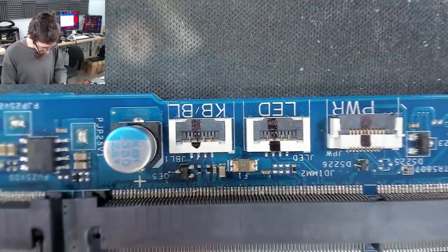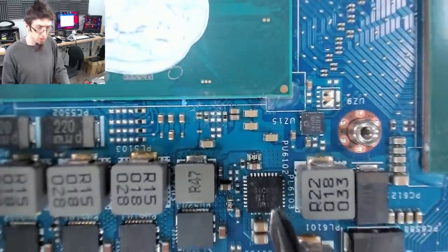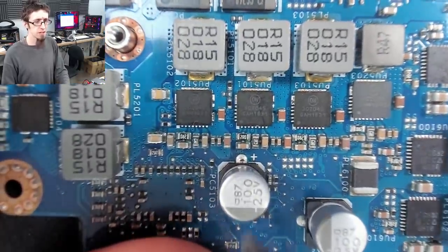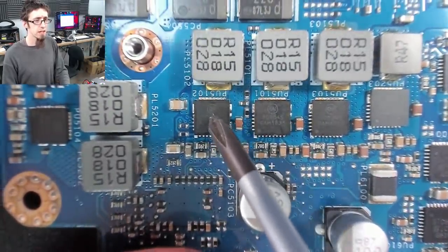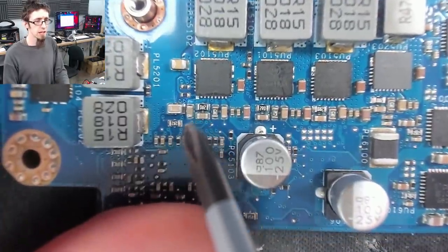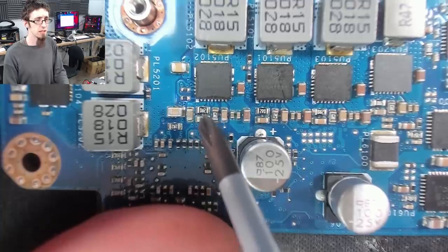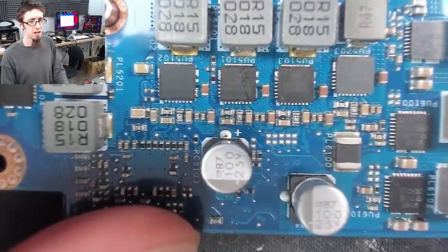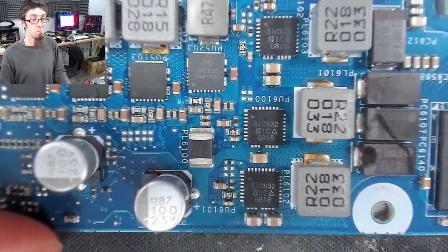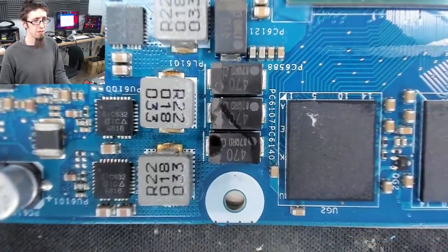And I would imagine we've probably got them. Where is power? Oh, those are the ones for the GPU. So yeah, they're just kind of far away from it. But yeah, anyway. So power stage for the CPU. So we've got our power stages, inductor, capacitors, CPU. And then supplying these, we've got another bunch of small surface mount capacitors and resistors doing various things. So we want to check if any of those guys have gone nuclear. So we're looking for any of them that look darkened or missing, or anything like that. And it all looks pretty good around there.